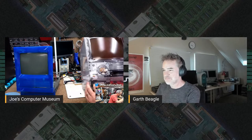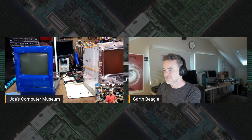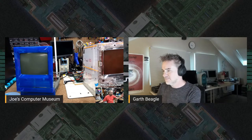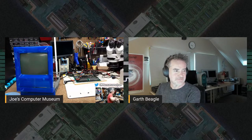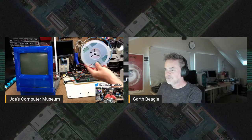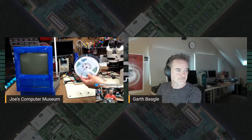And that is how many segments? I can't see it. It looks like it's 4. So we'll just call it 4. So altogether, I counted 35 segments. So what we can do then is cut 35 segments out of this, hook it up to the power supply and see how much current it draws, and then play around with resistors until we get to something that doesn't blow the computer up.